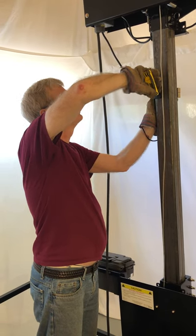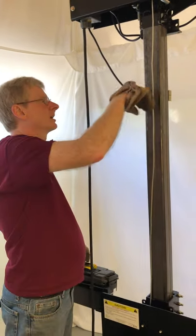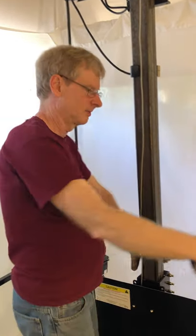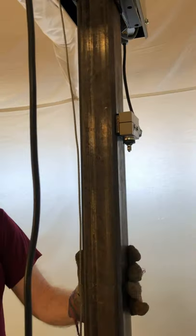You might need to adjust it up and down half an inch depending on your situation. Once it's on there, nice and firmly attached, you can always move it up and down a little bit. What happens is when the platform goes up, this bar here — this spring steel — will hit this plunger switch, and that will interrupt the going up circuit. So that's how that works.